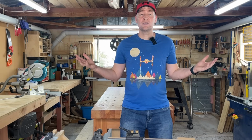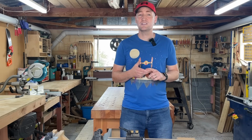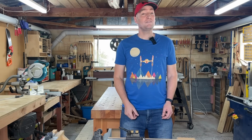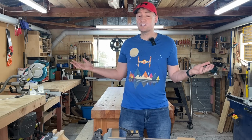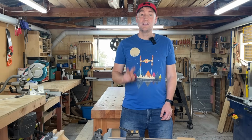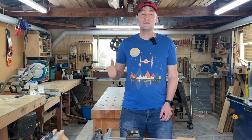So based on what I've done here, I've got a few tips that I'd offer you to make putting dust collection into your small shop cheaper and easier. The first tip is have a look at second-hand options first. You never know what you might find, and if you've got a small shop like mine, you don't need a brand new whiz-bang machine. The second tip is use drain pipe, 100 mm drain pipe.